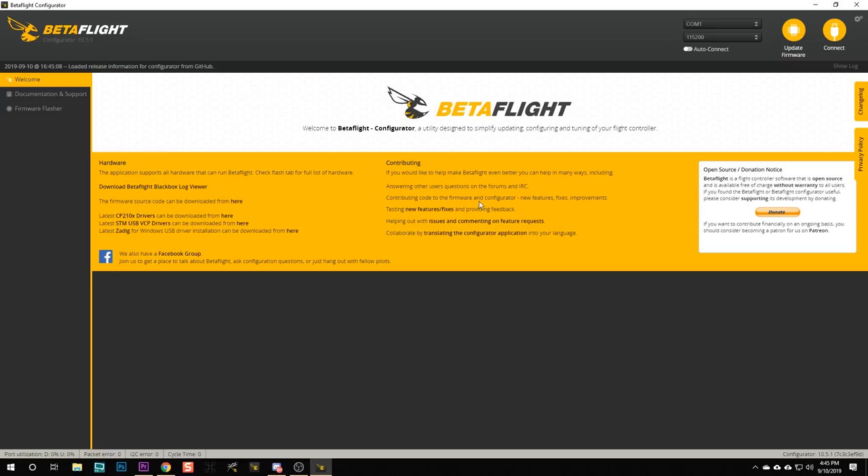Here on the computer, I'm going to start up Betaflight Configurator. If this is really your first time, you may never have downloaded it — I've got a separate video that walks you through downloading Betaflight Configurator, installing it, and installing the STM32 USB virtual COM port drivers. Link is in the video description. We're going to assume you've done that and now have the configurator ready to go. I'm going to plug this quadcopter into the USB port on my computer, and you should see a COM port number appear, indicating it's plugged in and ready to go.